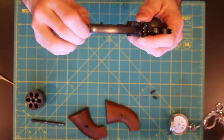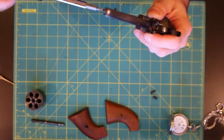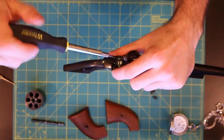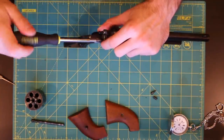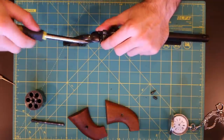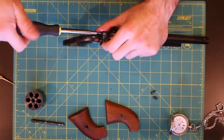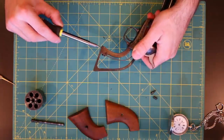Let's put the back strap in. I like putting the bottom screw in and tightening that up first — that tends to align parts a little bit better. Then let's go the two back screws about 80% of the way in. These two screws are slightly on the longer side. Then finish and make sure the bottom one's tightened up once those two are aligned.